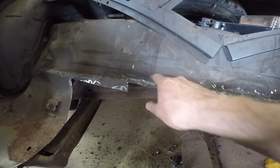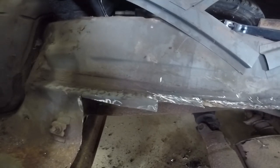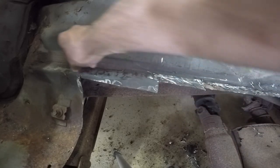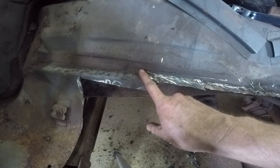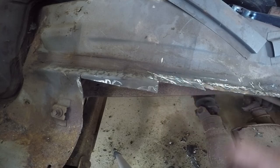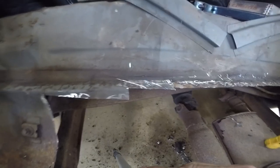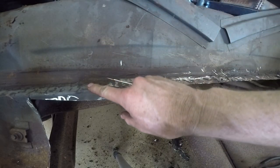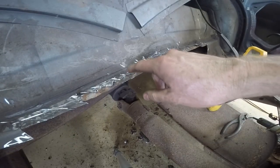When I started this I didn't realize it was gonna be welded that much. What I would do next time is just come in here and cut right along here and leave this metal on top, then just pop my holes in my seat pan and weld down to this instead of trying to clean all this off. If it was spot-drilled the way the rest of it is, it wouldn't be that much trouble. But what I would do is just cut right along here, leave this metal on there, grind it up, clean it up, and spot weld to this - because there's just a lot of welds in there.